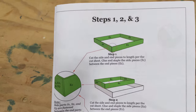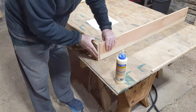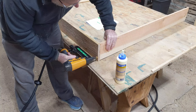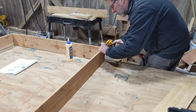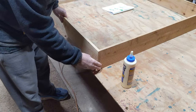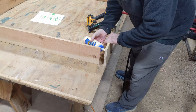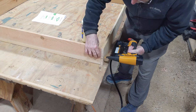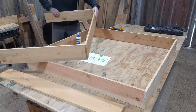The next three steps are building the boxes of the raised bed. The connections are simple butt joints — the sides are sandwiched in between the ends of the boxes on both sides. I glue and staple each corner using a pneumatic stapler with quarter inch crown staples that are inch and a half long. You could use a nail gun or nail it by hand with number four or number six galvanized ring shank nails. I set up on a piece of plywood to square up the boxes while the glue sets. It doesn't have to be perfect, but it helps when cutting and matching up the miters on the trim. I repeated the exact same process for the next two boxes.